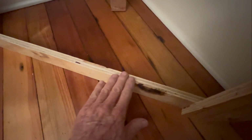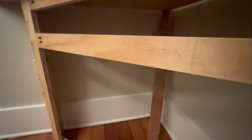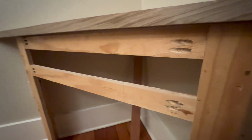The bottom toe kick, I guess it's okay. I'll just leave this back 3/4. There'll be a shelf here. It'll flush out, and the doors will be flush, so they'll shut into that. I don't necessarily need a back, but I need a support here for the drawer because it's going to be triangular, so it's got to have bottom glides. Okay, a few things to think about, but now we can move forward.